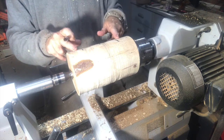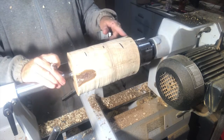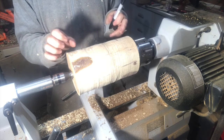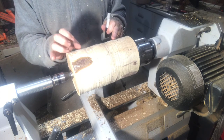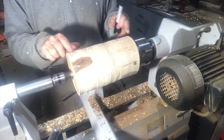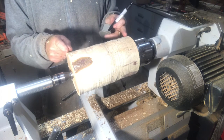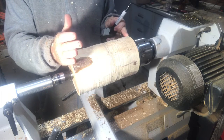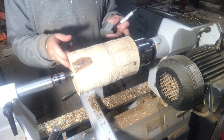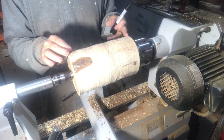and then we'll take these down so we can fit one into the chuck and one into the step centre. What you can do is physically use sacrificial glue blocks onto it. I don't particularly like that. I'm going to use another 4 inches of wood, 2 inches either side. I find it safer to work like that, so I would rather do that. So what we'll do now is we'll take these ends off, and we'll make another measurement, which I'll explain later on, and we'll take it from there.